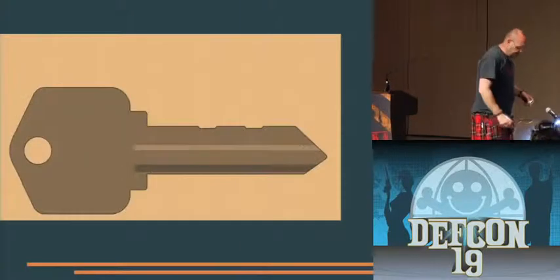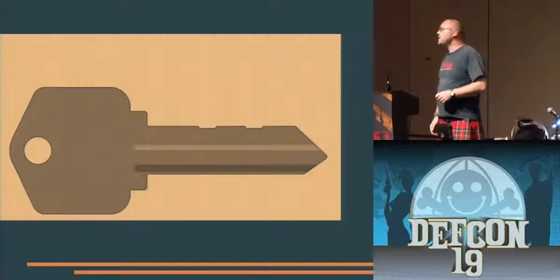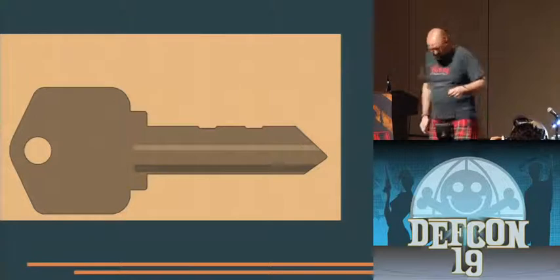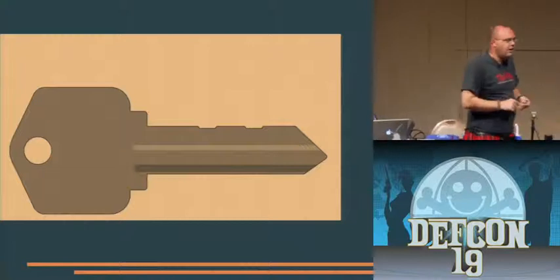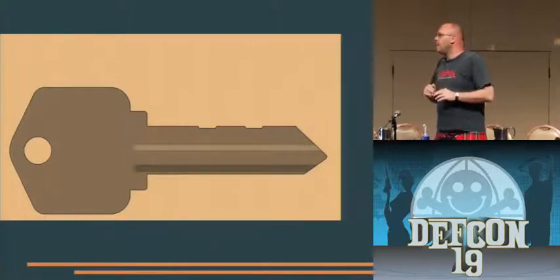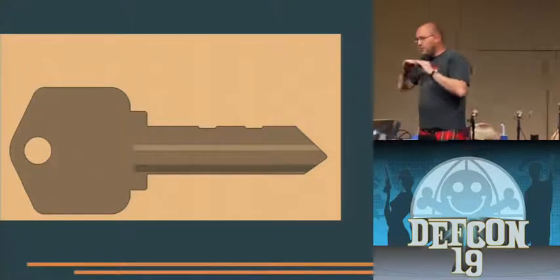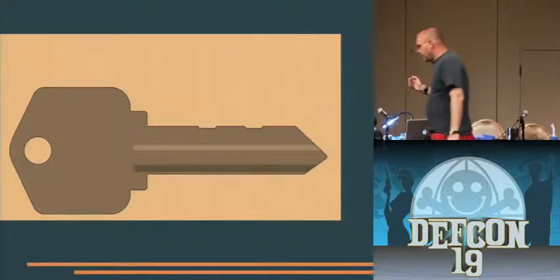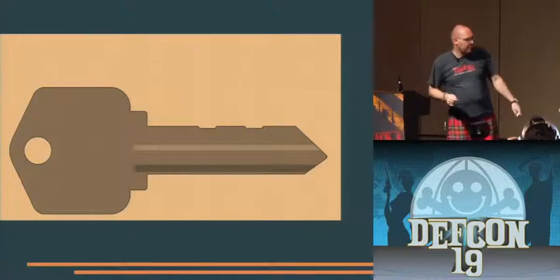So what we do then, at that spot where we see marks, we take away a bit of material. The key is a bit, and key was not pun intended. It wasn't. Because if you know your brand of lock, then you know what the possible key depths are. And you can start off with the highest possible biting. If you file your key off to that biting, then you know you have to go one step down. And that speeds up the process considerably.